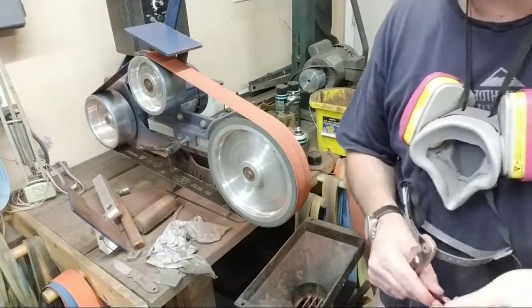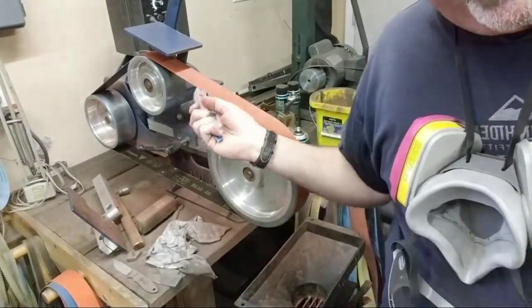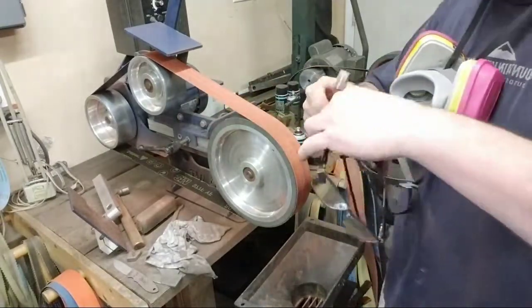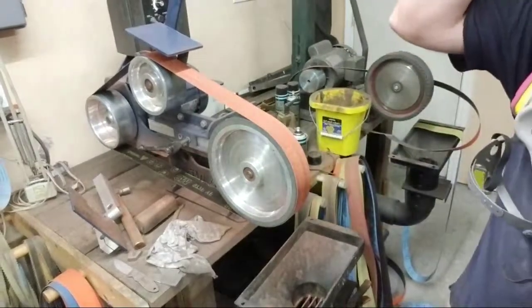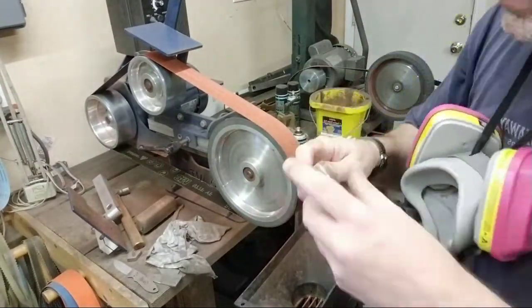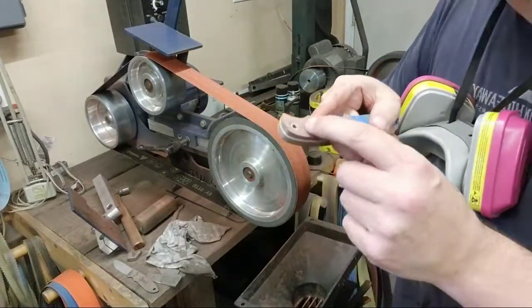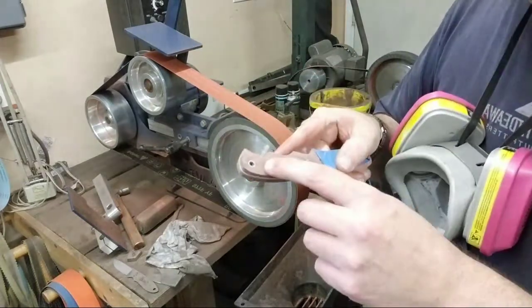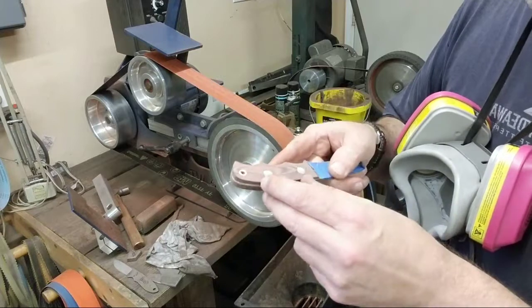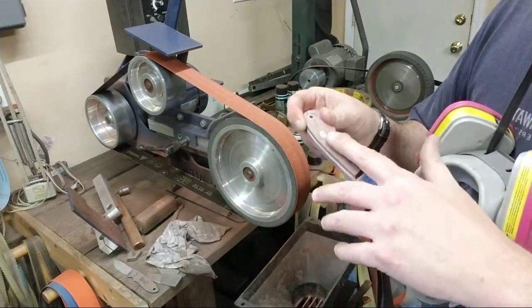And here's the thing. Some people will want to shape that on the slack portion right here, okay? Whenever you do that, and you have large bolts or large pins, these are 1/4 inch, okay? What that's gonna do is you're shaping it up here. It's gonna wanna shape the softer stuff, which is the handle material, before it shapes the pins or the bolts, whichever way you have it, okay? So that's gonna make it lumpy, okay?